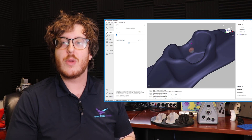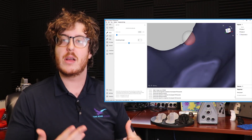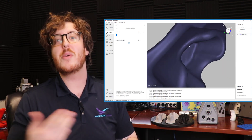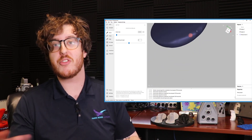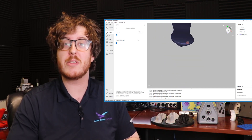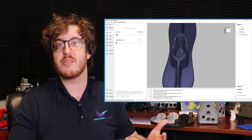Do keep in mind when doing this cleaning that the de-feature tool will remove a bulk of data, but you're not going to want to use it for everything. We're not going to want to remove all those micro cracks with it, which is why we use that combination of de-featuring for the bulk of data and then the smoothing brush to give a nice even look to it all. It's very common to go through and use that smoothing brush to really clean up and give a nice even surface finish before doing any kind of printing.